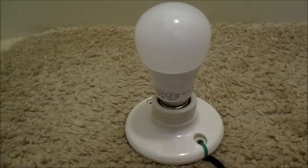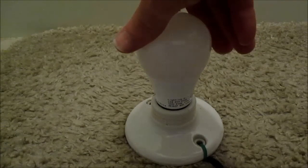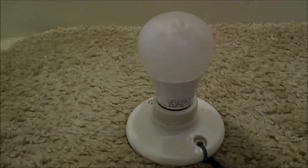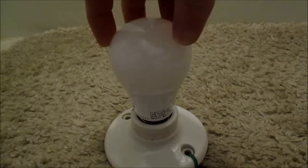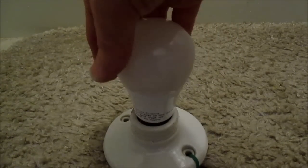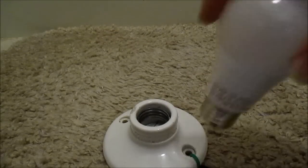I'm in the bathroom now — it's a room that I can make fairly dark in the daylight. Let's see what happens here. You see it flash? See it flickering? Let me unscrew it. It doesn't do anything when unplugged. Well, it was before — when you unplugged it, it would actually flicker a little bit. But it's not totally dead. There's like some flickering with it. I'm going to guess something with the regulator, because the LEDs flickered a bit, telling me they're not completely open.